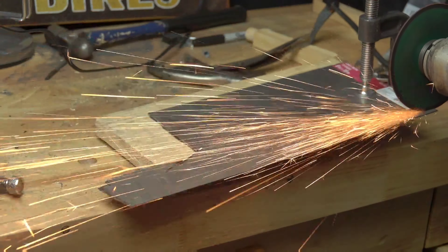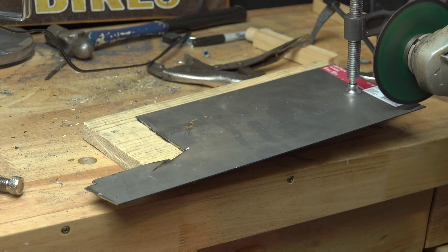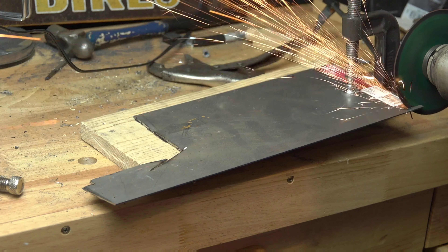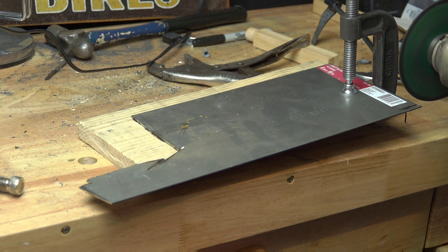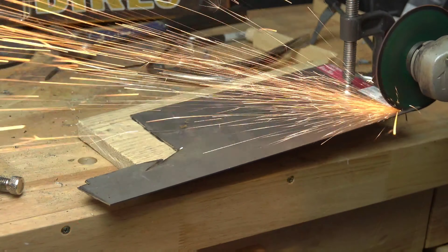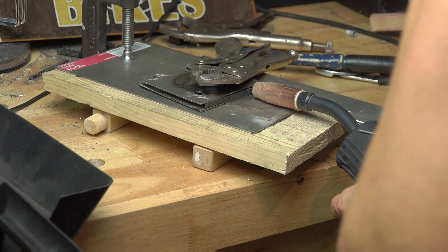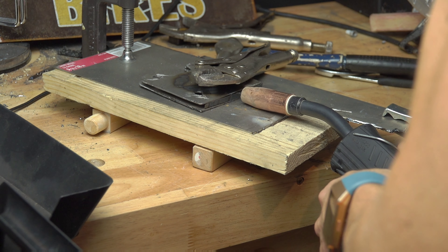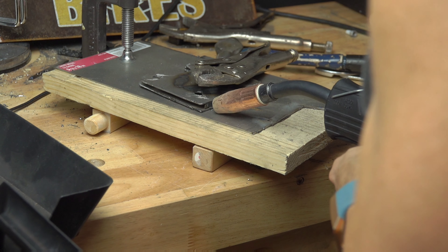Since I'm going to have a gap on the outside — because the piece in the middle creates a separation between the two plates — I decided to cut a strip of sheet metal to give it the same shape as the plate. That way I'd just weld it around, then grind it and make it look perfect. The metal strip cut from the sheet metal would be welded around the part, making it sturdy and fully enclosed with everything on the inside.